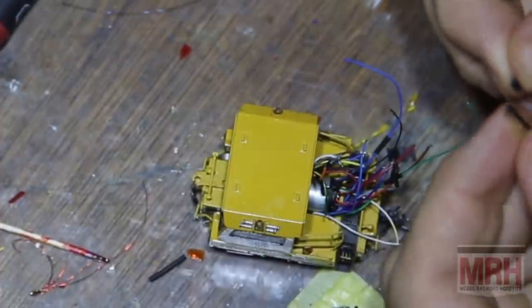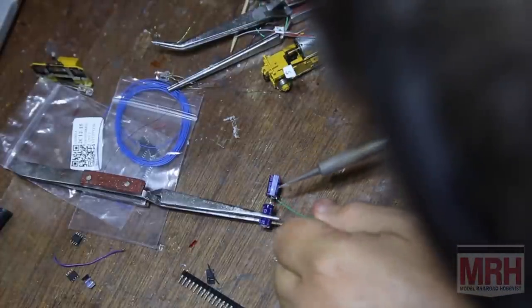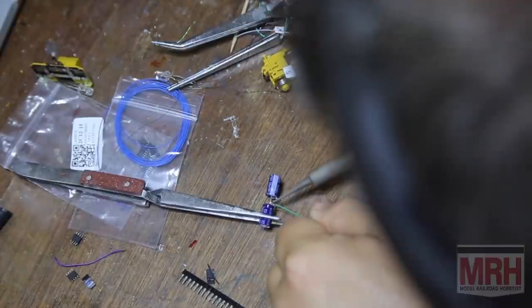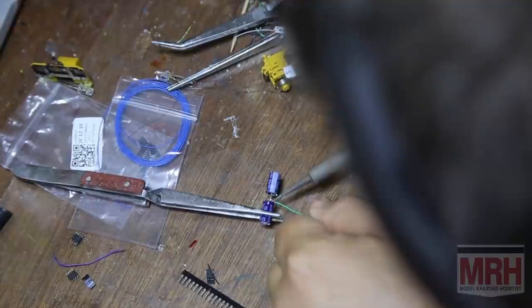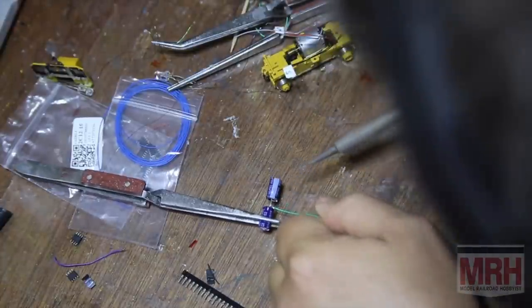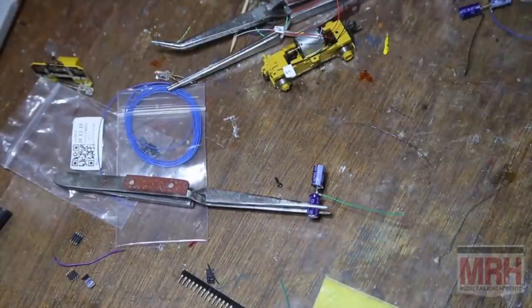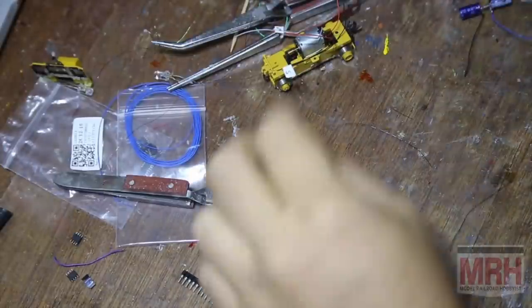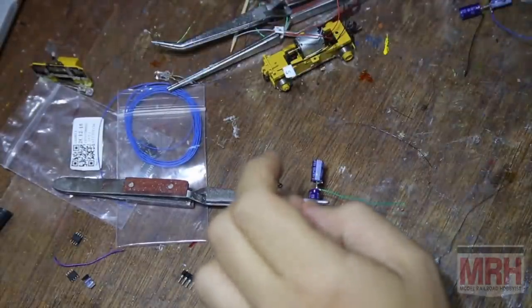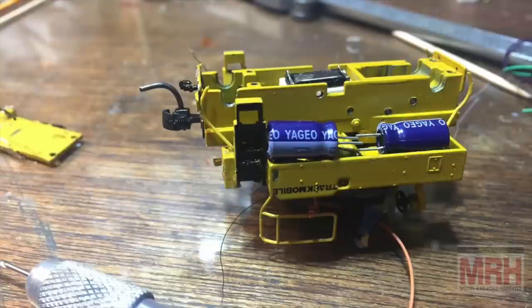This left one major issue to address with the trackmobile, and that was its unreliable performance on turnouts. I knew I didn't really have space for a conventional stay-alive capacitor, but I wondered if I might manage to cobble one together by wiring a few capacitors together and hiding them in plain sight under the frame of the trackmobile. I asked George Bogatuk for recommendations, and he suggested I try soldering four 25-volt, 220 microfarad capacitors together in parallel, which could provide a second or two of emergency power.